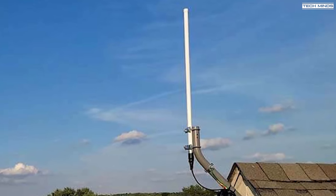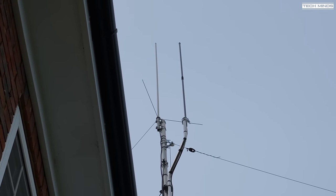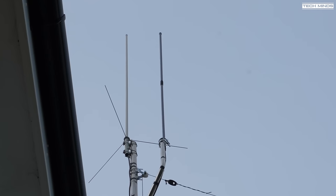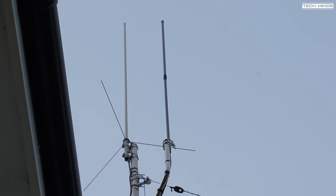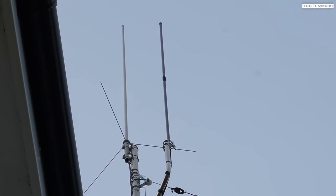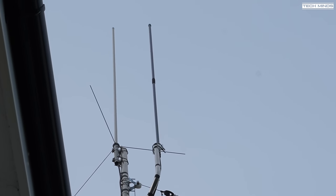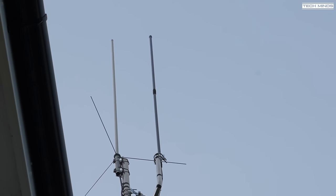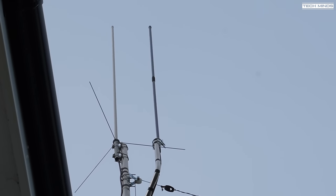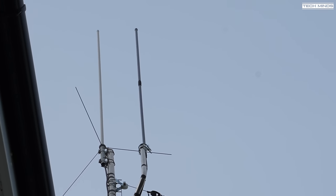It's not uncommon for most people to install the electronics of a LoRa node at the base of the antenna, which cuts down on signal loss in lengthy coax. But there is a way around this if you don't want to mount the electronics at the base of the antenna and prefer to have the equipment indoors — and that's to use a high-gain antenna and extremely low-loss coax, both of which can be expensive, but it will be worth the extra money for the performance you'll obtain.